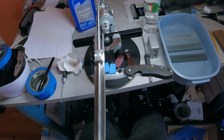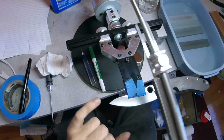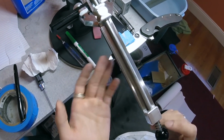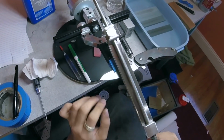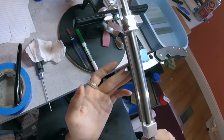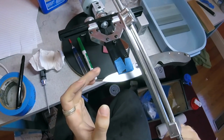Now what that looks like for actual getting work done near the tip, you can focus, again, don't do this early, wait till you have your whole bevel, but you can kind of reposition yourself so you can see what you're doing, okay? Give it a little bit of a twist, just barely anything. When people say add pressure to one side of the stone, they don't mean do this, they don't mean push, they mean this tiny rock that there is. You just want contact. So give it that tiny rock, okay? This is okay. That's not going to round your tip.